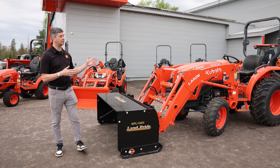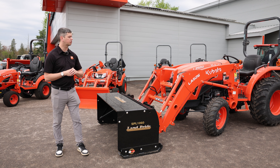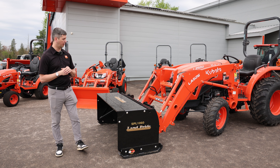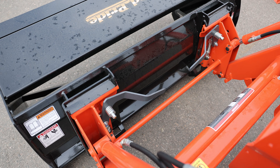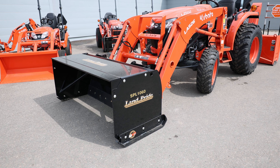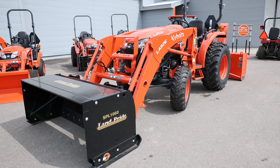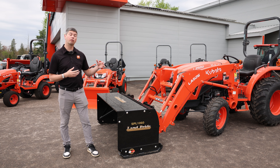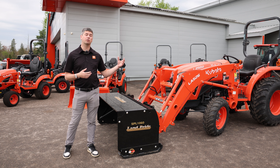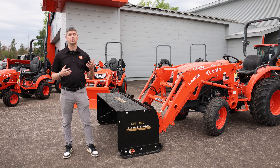It's sitting at about 60 inches wide — a little bit less, about 58 inches with these tires on it. So 60 will work fine. Normally what you're going to have here is a 66-inch front bucket. That's bigger than the LX and not as big as the Grand L bucket. The Grand L bucket is 72 and the LX is 60, so this is right in between, and it matches perfectly with that loader. This is the LA 526 loader — meaning you're lifting 526 kilograms.